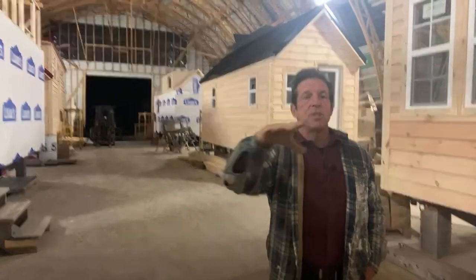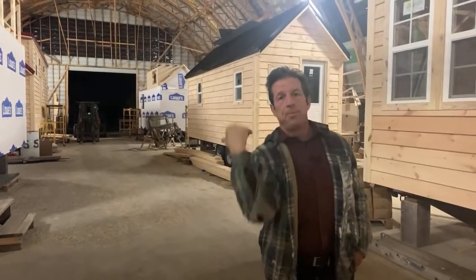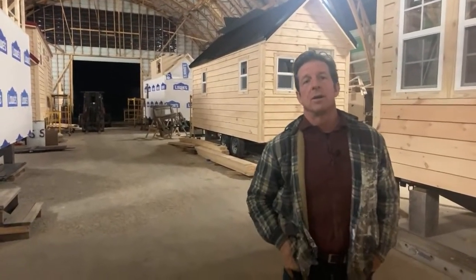Do you have any designs that are handicap accessible? Well, my mom's house is handicap accessible, and I always say if you want handicap accessible, go at least 10 foot wide. That gets you around kitchen cabinets and into the bathroom. You want 36 inch door openings and a shower that doesn't have a lip. We can set you up with grab bars around the toilets, the showers, the living room. My mom lives in one, all on one floor. She's able to sit, watch TV, eat, and get to the kitchen and bathroom with her walker.